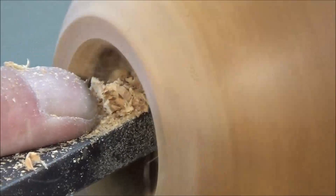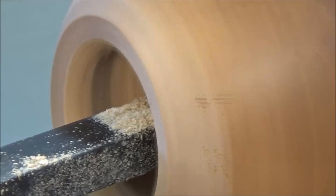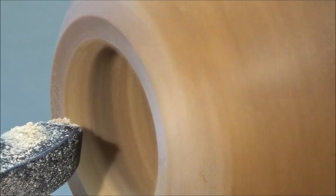It's a little bit at a time. Bring the tool in and towards the middle so you don't leave a shoulder, and you catch with this side of the cutter. Always remove the wood in front of the cut.